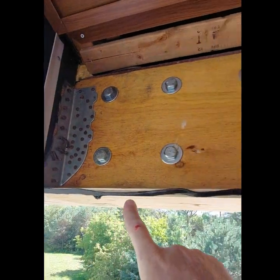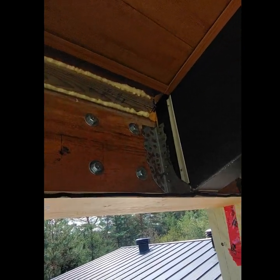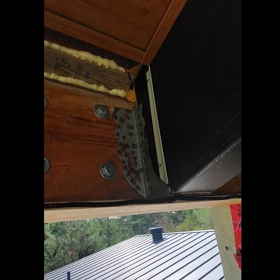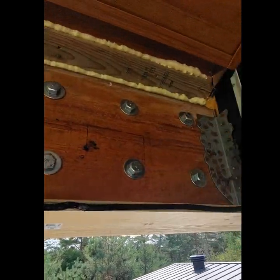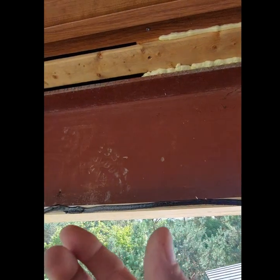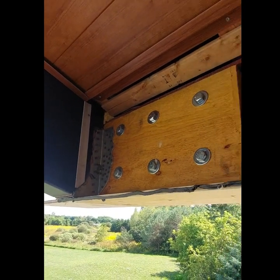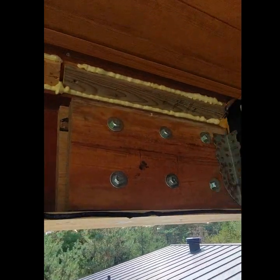Here's one more thing I like to do — I try to use as few fasteners as possible. I always take my leftover caulking tubes that have been open and started drying slightly — not good enough for a finish bead — and use that as glue on the edges. I only put some on the ridge, and that allows flexibility for contraction and expansion during different seasons. It kind of sucks the material in place once I set it.